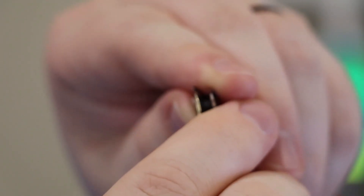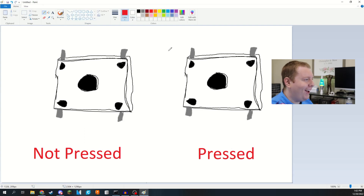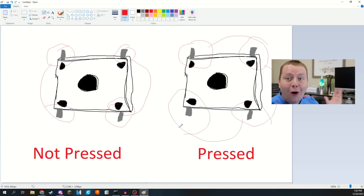If that explanation didn't really make sense, you can get out your multimeter and set it to resistance mode — that's how I usually test my button. I'm just going to draw this in MS Paint; it'll be easier. So here's the point: these two pins are connected even when it's not pressed, as are these two pins. But when you press it, all four pins are connected.